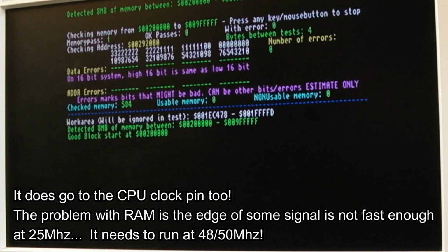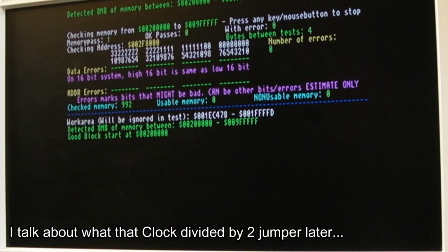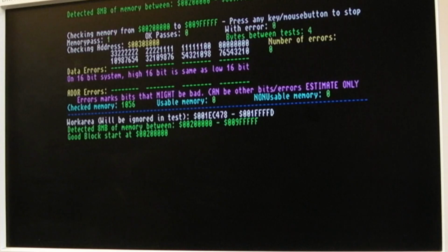But I think what you need to do is cut... Maybe you need both resistors there. No, but hang on a minute then, how would the CPU be getting its clock? This is the thing: both the right-hand sides of those resistors go to the same place, so you'd end up having two clocks over the top of each other if you don't separate them. I think you'd need to cut the two pads so they're not joined together, fit another resistor, and then the FPU will have... Oh, hang on, no, you'd need to cut the trace to the FPU socket. I don't really know how that was intended to work, but we've turned a corner, because that is working, isn't it? Oh, I'm so pleased.